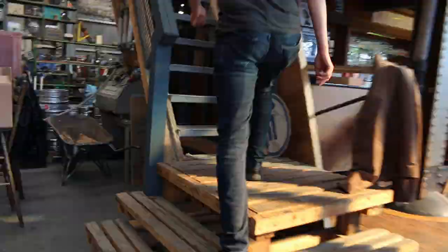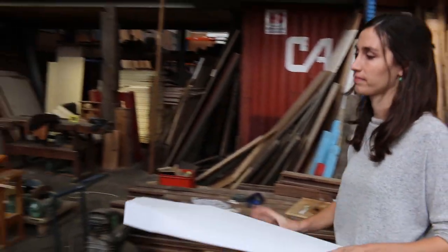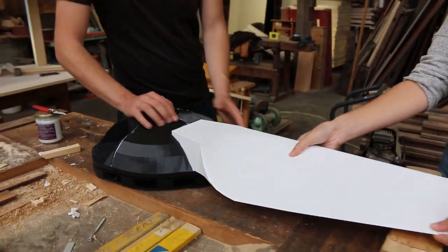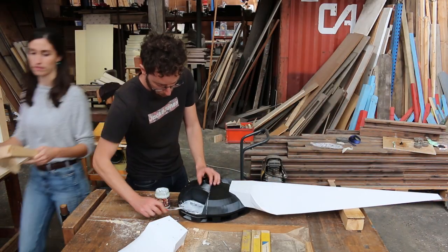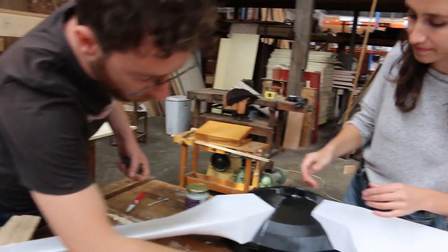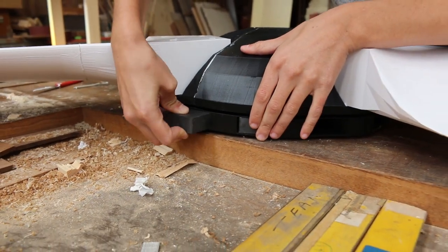After 24 hours, the weld will be strong enough to hold the blades. They can be welded or bolted onto the generator. A weld is stronger but comes at a cost of replaceability. The blades are carefully placed in the generator so that each blade is at the same height. We have to work fast because the product that makes the bond evaporates quickly. After this, the magnets are fitted into the generator, and later we will cover them with the same glue to prevent them from flying out.